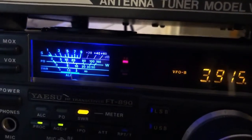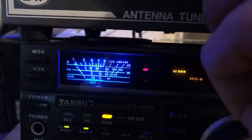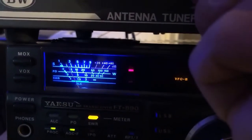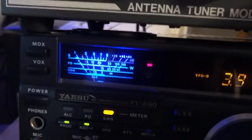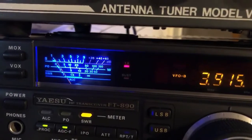Find the best point at the lowest SWR, then go to the transmitter knob and turn that until your SWR goes down. Then go back to the antenna knob. There you go — flat 1:1 SWR.